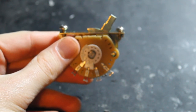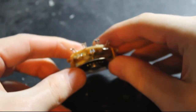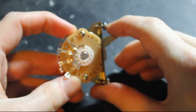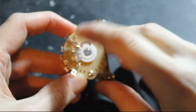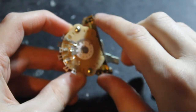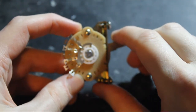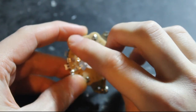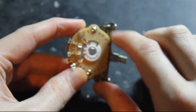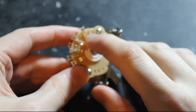Next we have the five-way switch. As I switch this, you should be able to see exactly what it does on the side. There are two rows, so exactly the same is happening on both sides. There's one on the end that is always connected, and all this is doing is changing which of the others connects to that one in any given position. So we connect the pickups to these, and as we flick through it, it changes which pickups are on — neck, neck and middle, just middle, middle and bridge, then just bridge. The switch literally just switches between them.